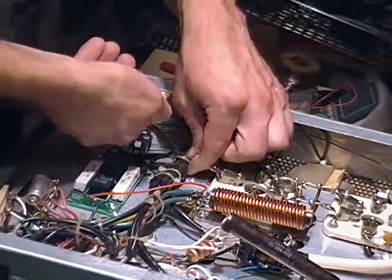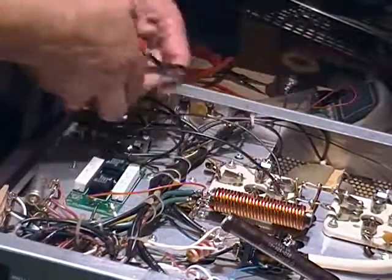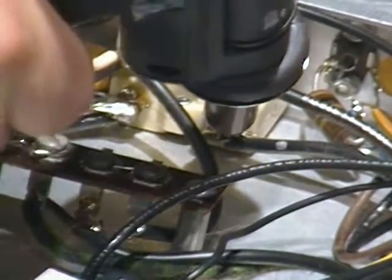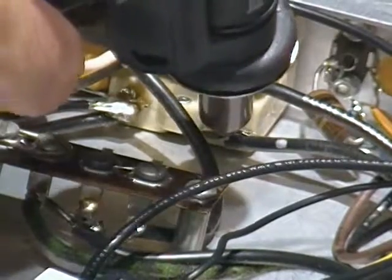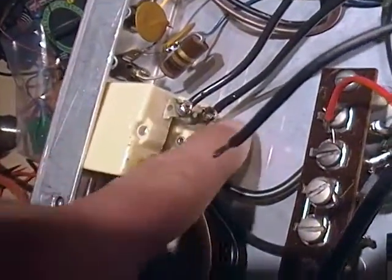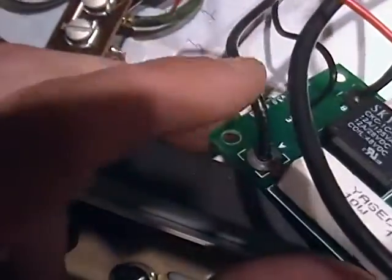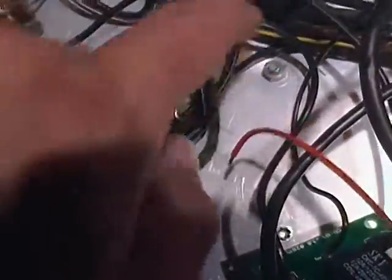We need to get into this wiring harness and cut these zip ties. Pull the wire through and use the desoldering pump to clean it up — there's quite a bit of solder on there. The wire was actually desoldered from the bottom of this breaker panel. I desoldered it and soldered it onto lead C. Then out of lead A that comes out of the kit board, it now runs into the bottom — I soldered it on there.